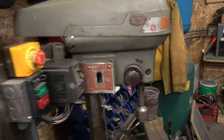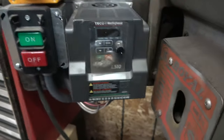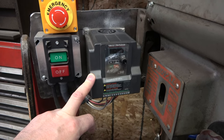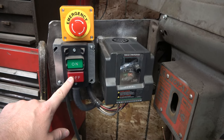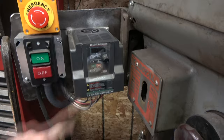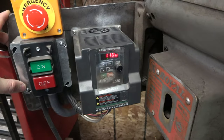I did it to this drill press — this is the L510-101 single phase. What I initially did was have this inverter powering the motor with a switch after the inverter. Well, that's a no-no. The inverter turns on and shuts off the motor. So this on/off here is just to power up the inverter.